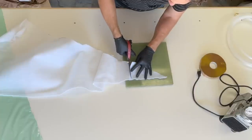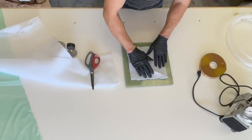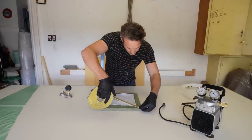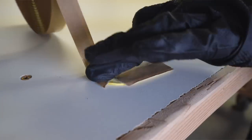I'm not actually making any parts here. I'm just trying to get confidence in this system, including this new to me pump and all of my other vacuum bagging parts and procedure. As I'm putting down this vacuum tape, I've decided to tear the paper backing a bit and stretch it around the corners instead of doing overlap joints. This just reduces the number of leak opportunities.